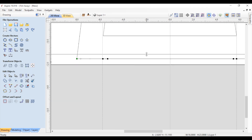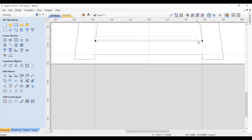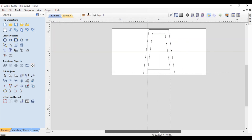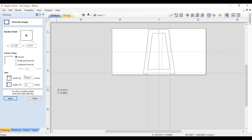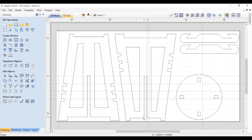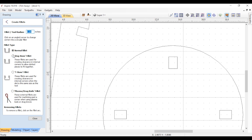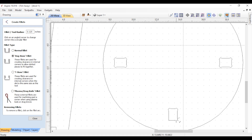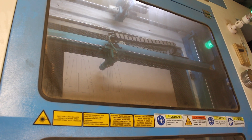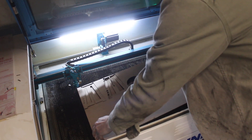It's all real basic stuff. I also created another rectangle on the inside to run as a stripe down the center, then used the scissors tool to snip and connect all of the vectors into the positions I wanted. Jumping ahead, you can see my first design. I wanted to add some dog ears to the holes in the top of the stool so I could slide those pegs in and out without them getting stuck. I didn't want to waste a whole three-quarter-inch sheet of plywood, so I shrunk the file down exactly one-third the size and cut it out of quarter-inch material on my laser cutter.